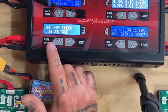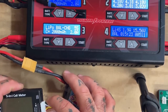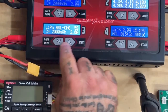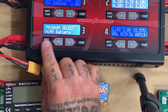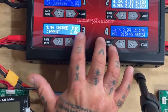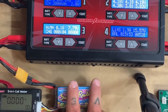So we're going to try something a little different. Here's what we're going to do: we're going to exit out, and we're going to leave the XT60 plugged in, and we're going to take our balance lead and plug it into our meter right here. I'm going to go to my type and change it until I see nickel metal hydride right there. And I'm going to hit start. Then I'm going to set it to manual and set it to two amps and hit start.